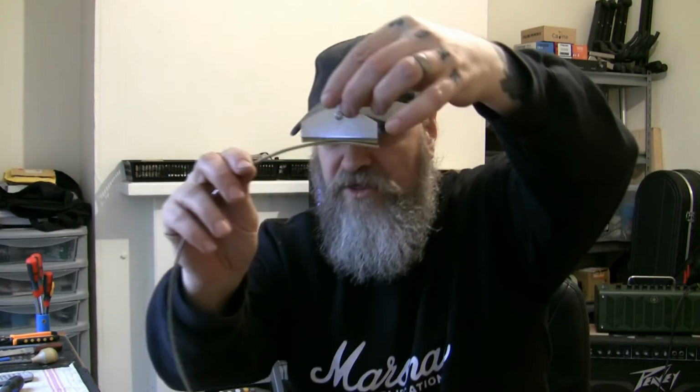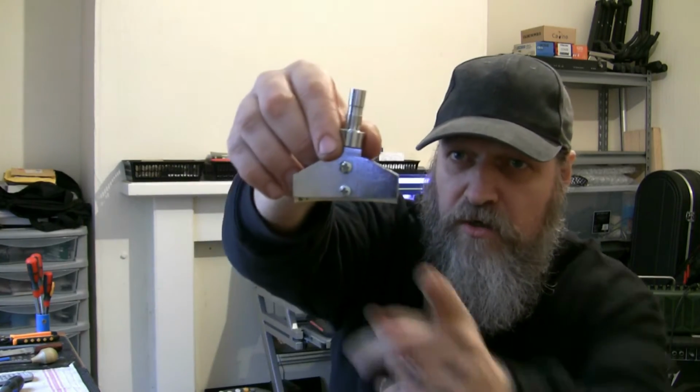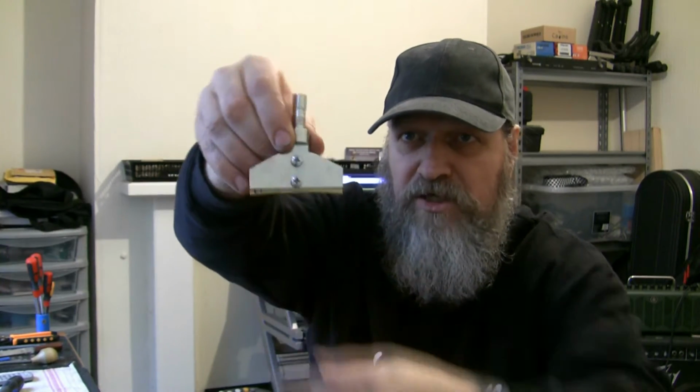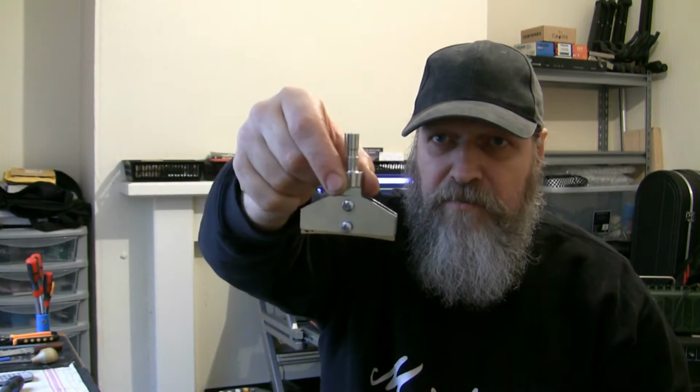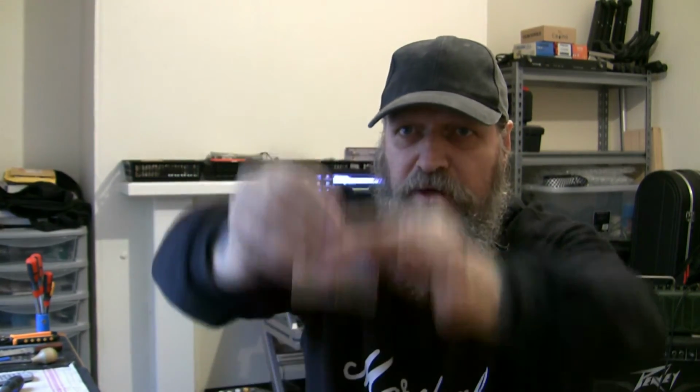There you go, so I don't know what you can see there. And how we put them in is, you can see on the end here, I've got these cauls, and they're grooved. And this is set to a 12 radius. I've got loads of these, I've got a full set of them. And this sits in my pillar drill. And when I pull the pillar drill down, this goes boom and stamps it in. So that's what I'm going to get on with.